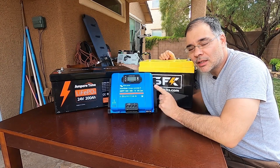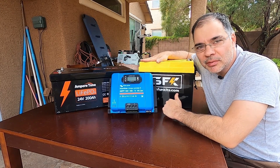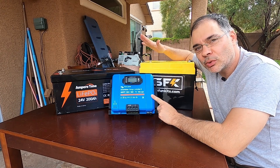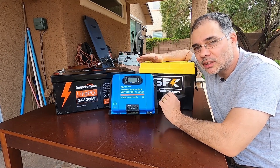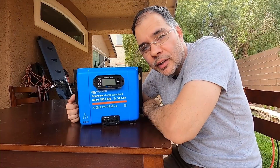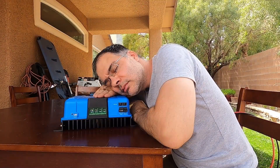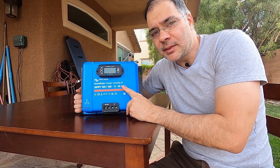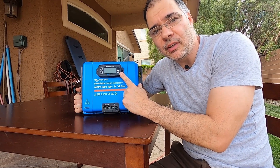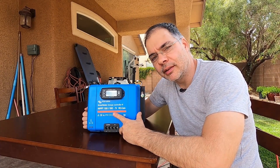The other thing I really love about this unit — multiple charging voltages. You can start with a small 12 volt battery and then later, as your system grows, upgrade to a 24 volt battery using the same charge controller. The other thing I like about this unit — it's perfectly quiet. You can sleep right next to it and not even know it's running. So although this unit is expensive, around $800 with the display — the display is $50 — you're paying for quality and scalability. It's kind of like a buy it once, buy it for life kind of thing.